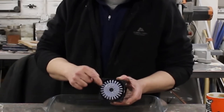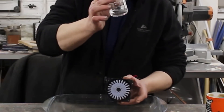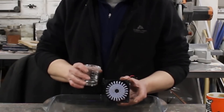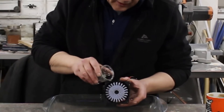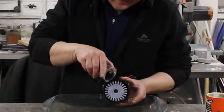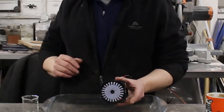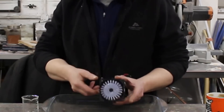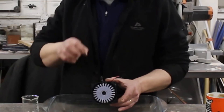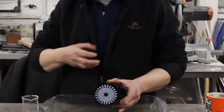This is a Pelton — a little bucket version — it'll function just fine. I've got 20 millilitres of water here, about 20 grams. If I pour that onto the Pelton... there's not even enough mass in there to turn that wheel. That's not a surprise — it's trying to turn a generator and a PC fan and it just can't do it. We'd need much more mass of water with greater flow.